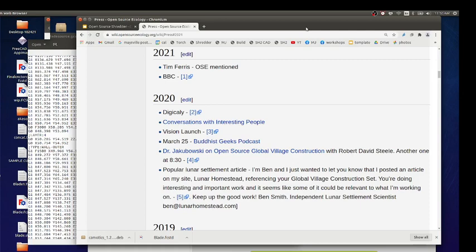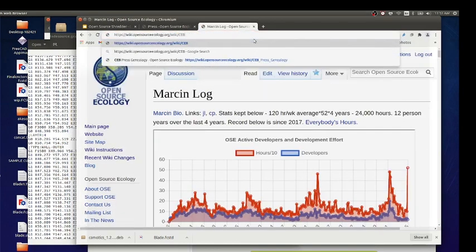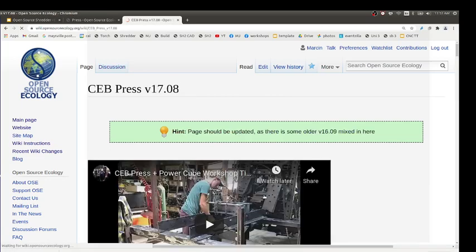Yeah, so I just wanted to revise the question you just asked. I'm thinking about input and output pressure, right? When we're pressing, we're doing the highest amount of output pressure. Yep. And so we want to press on the side that has the most surface area available from the piston. But that means we need to be putting pressure in on the side that actually contains the rod. Well, no. Liquid's going to flow out on the side of the rod. Yeah. So I'm saying that if we want the high surface area side to be outputting pressure, then while that's happening, we need to be inputting pressure on this side, right? Isn't that what we're saying? We're pushing hydraulic fluid in here to force that to go that way.